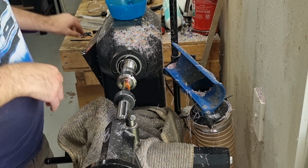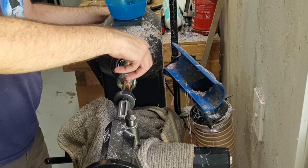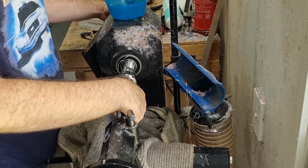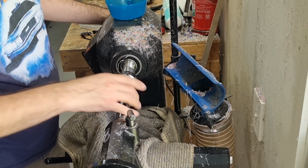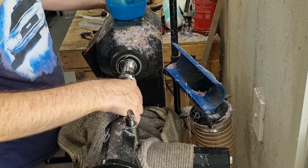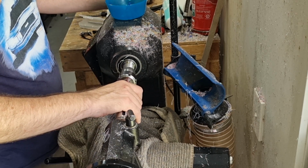So just clear away from the inside all the material. More WD-40. And you have to be a bit careful that you don't cross thread it. And you almost immediately go back to the original one. And then, as you're pulling it off but pushing in at the same time, it'll sort of click when it goes to the next starting position. And that way you can see that it stops somewhere different.